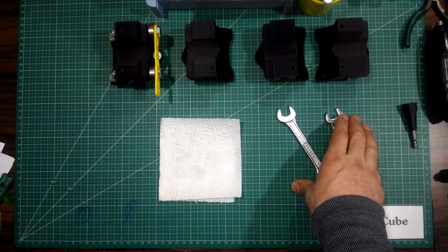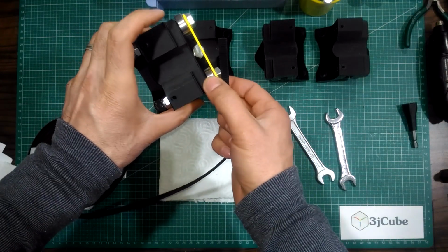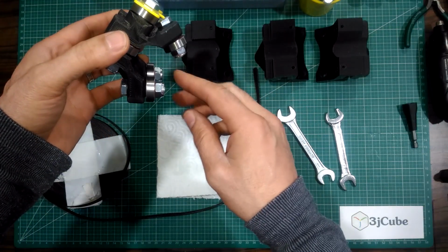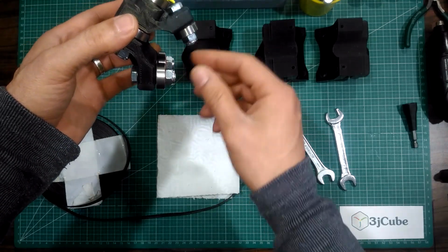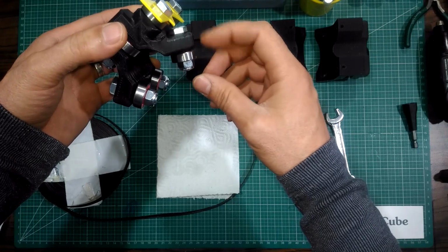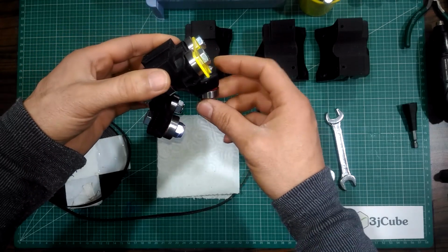So as you can see, it does not sit on the single bearing, so I will put another bearing here, and also I'm going to use supporting for the tubes. I'm afraid that the supporting will hit the bolts, the nuts here, so I'm going to rotate this switch. The bolt head will be under the roller.